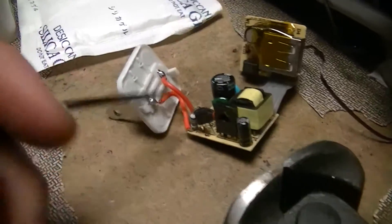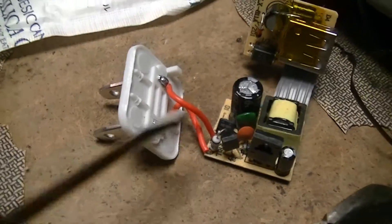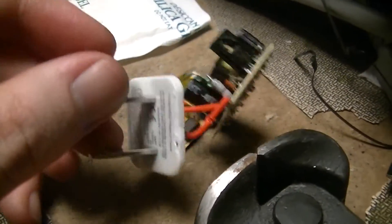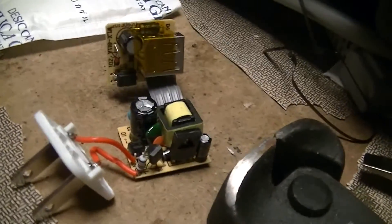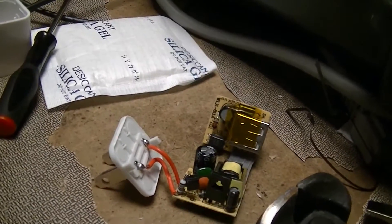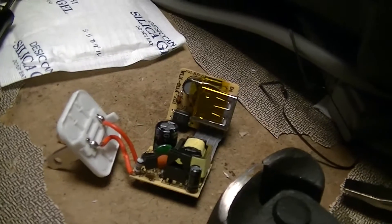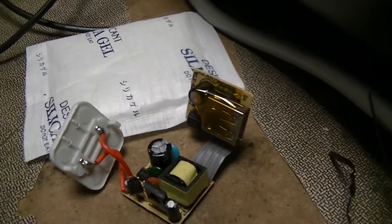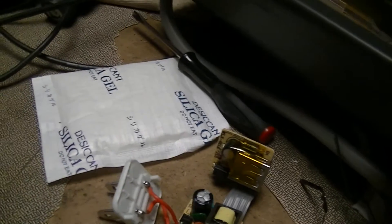There's also a fusible resistor in series with the input. I don't trust the component ratings in the slightest. There's mangled insulation on one wire which was like that when I opened it up. In theory this thing could handle 240 volts; I'm going to test that outside because I don't want it stinking up my house when it probably blows up. As a safety measure, when I was doing all those experiments I was running it through an isolation transformer — didn't want the thing making my scope live, blowing it up, or electrocuting me.